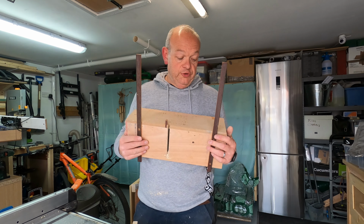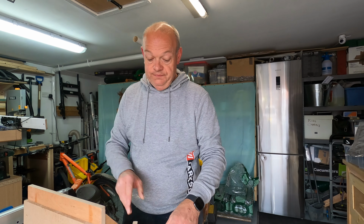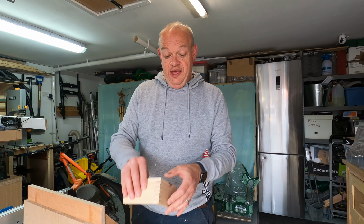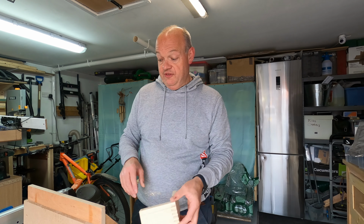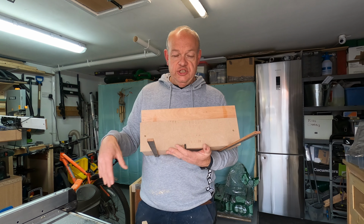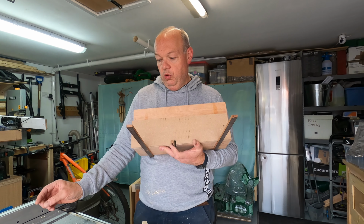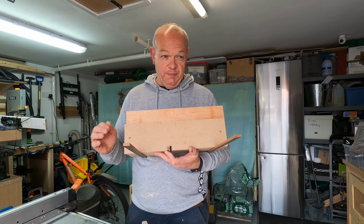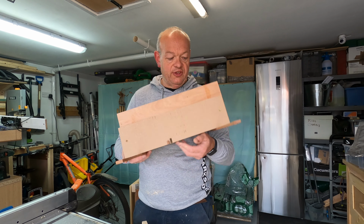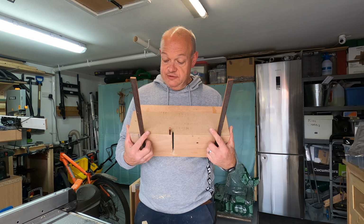But I set out for two things. Number one, to create a box jig that worked, and I've done that. I've got a box jig and it works, and it's really nice and flat. It's a really good right angle, so I'm very pleased. And the second thing was to make sure that I was able to use my table saw with my grooving blade, which, as you've seen in the video, hasn't been a problem all the way through. So that expanding ring that I bought, the Bosch expanding ring, I'll try and leave a link in the description, has worked perfectly. So it's allowed me to use the blade. So overall, really pleased and really impressed that it actually worked, and it doesn't look too bad either.